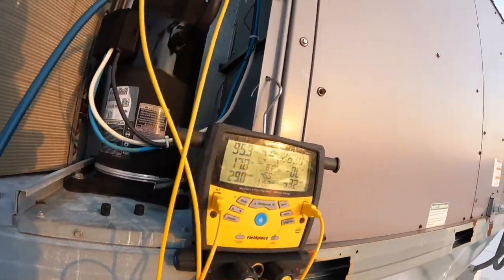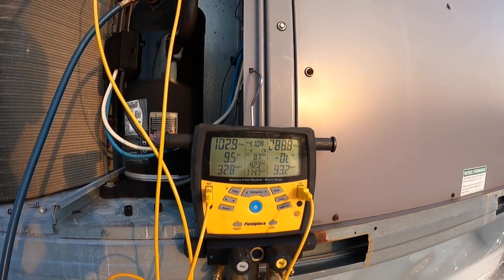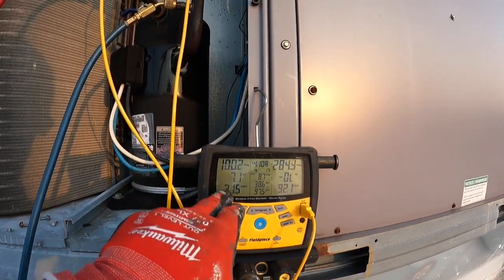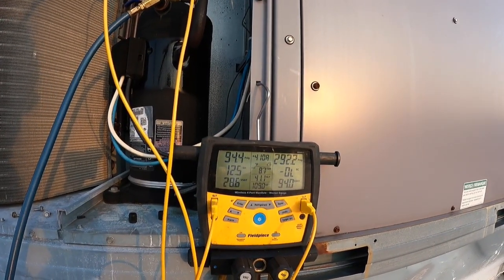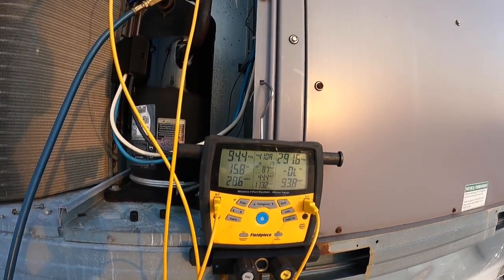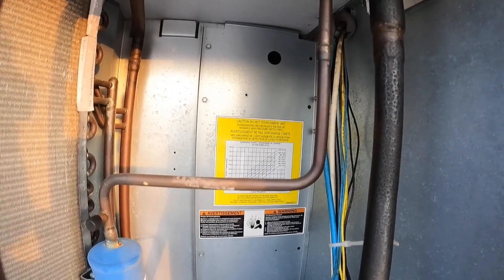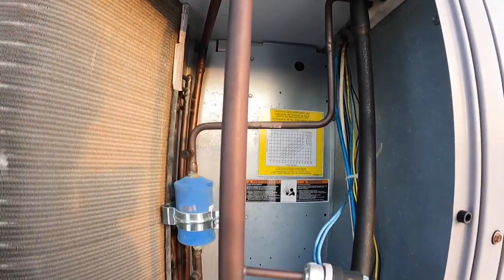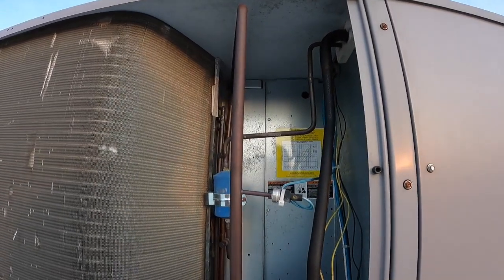The pressures are teetering up and down about 15 to 20 PSI. It's about 60 to 65 degrees inside and 55 degrees outside, so we're not really in the conditions that would be cooling. These numbers are a little lower than what I would like to see, but we don't typically check cooling charge levels in the winter months. This is a gas pack so we can't put it in heat mode to check that. According to this graph, we're within a few PSI and degrees of what I would project it to be. We'll check it again in summertime — our next scheduled maintenance is in July and it's January now — we'll come out and check it before then just to make sure it's right. If you like this video, please give it a like and subscribe for more content like this.